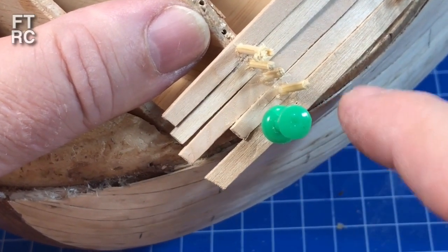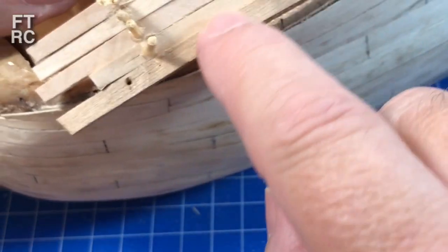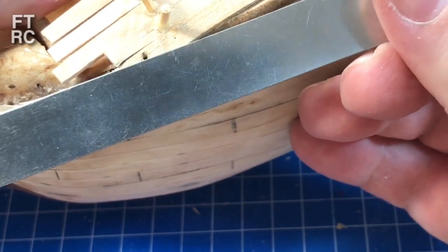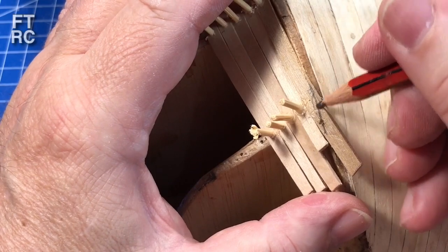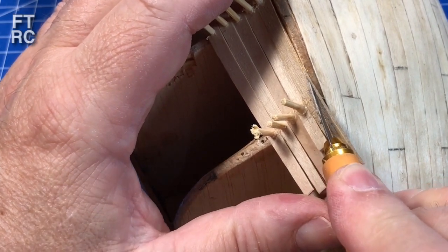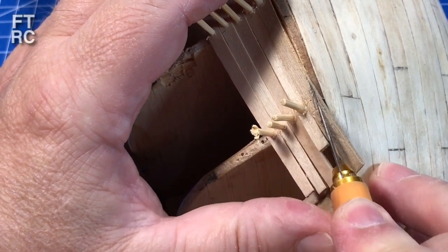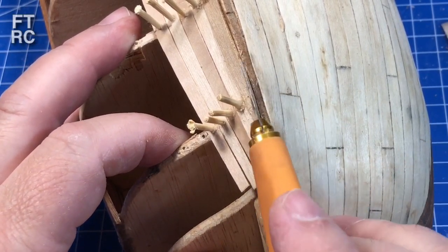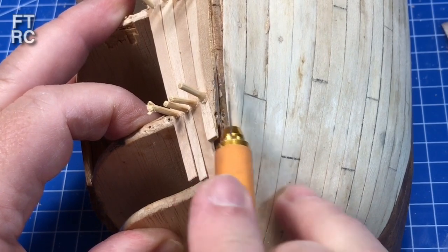This is where the garboard plank has to do its reverse taper. It's the only time we do a taper on the bottom of the plank, and essentially it's hardly even a taper — it's more of a straight line because the garboard plank is actually curving along there. We need to know what that straight line is — it's easier to get that line if you look directly down the right angle on the keel, then you can just pencil it in, feather it a little, and it's a simple matter of getting the knife and running it against the edge of the keel.